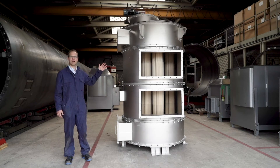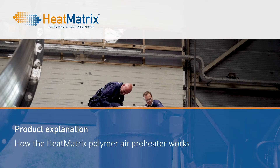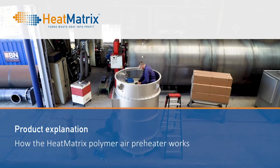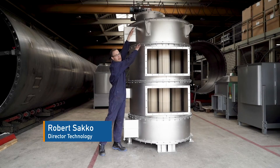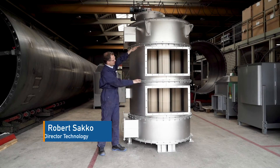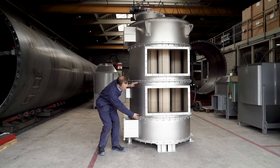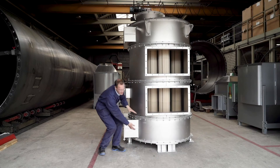This is the Polymer Heat Matrix Air Preheater. The heat exchanger consists out of four sections: the top section is the flue gas inlet, this section here is the hot air outlet, this section here is the cold air inlet, and this section here is the flue gas outlet.